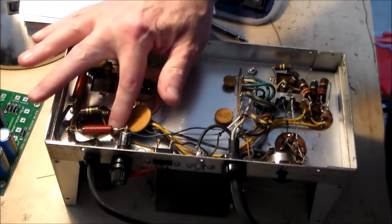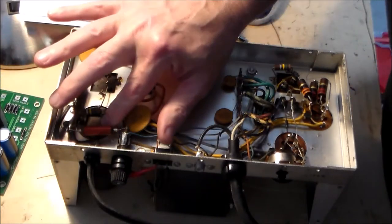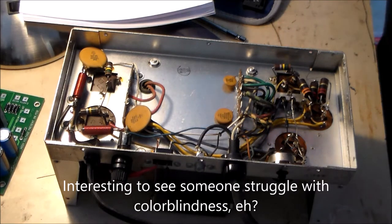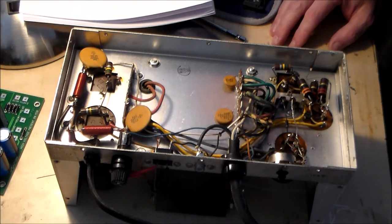What's red and what's not? Unsolder the one red wire from the leftmost capacitor lug. Move this lead over to the second lug from the right on the terminal strip.